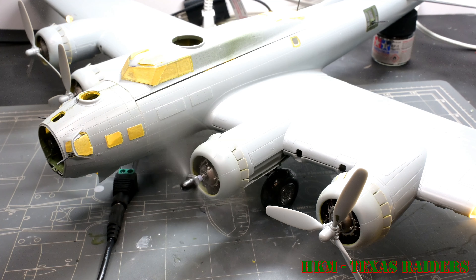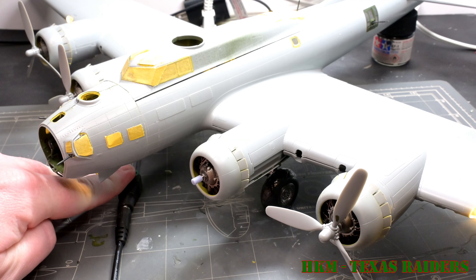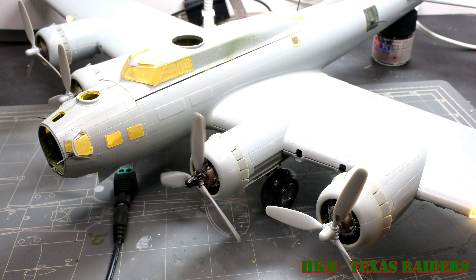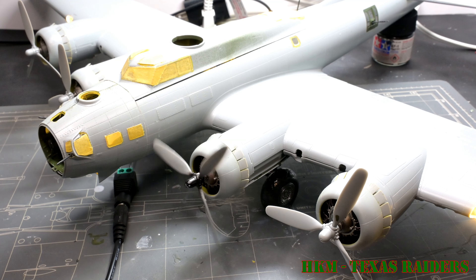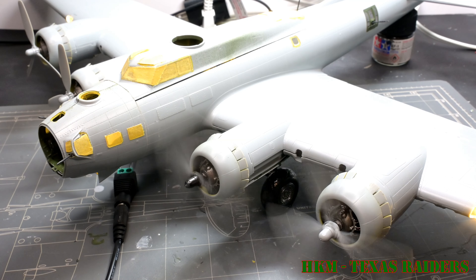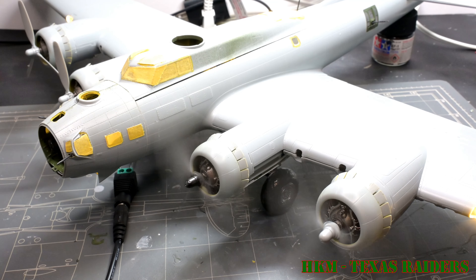As you'll see, there's a propeller departure from engine two as it flies across the room — just a minor issue. Running it through a second time filming was much more successful. There's a little variation between each motor's speed, which is normal — some variation in the windings, and they haven't been run the same amount, so there's some run-in as the bearings break in and friction decreases. Each propeller also weighs a slightly different amount, and they're vibrating because they're not balanced yet, so not overly surprising.